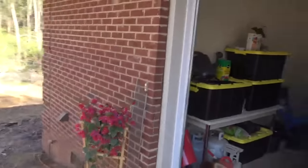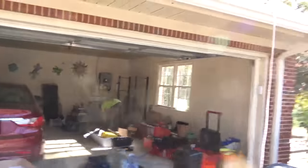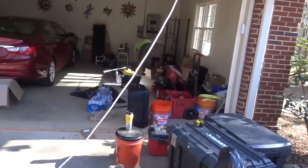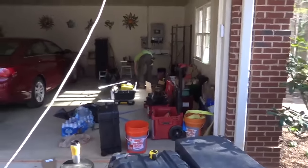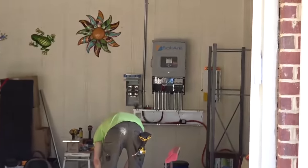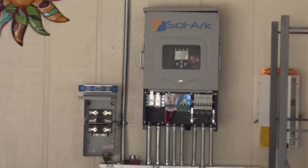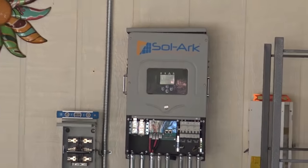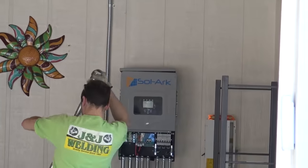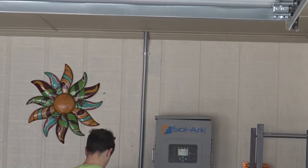What's nice about this job — everything is nice and close. Dusty is working on the critical loads panel, consolidating breakers. They have upped each leg of the inverter to 6,000 watts and they've also been testing — they're exporting 9,000 watts continuous out of the solar converter. That's pretty impressive. We've been monitoring several systems and we see it just exporting 9 kW for five, six hours in some cases.